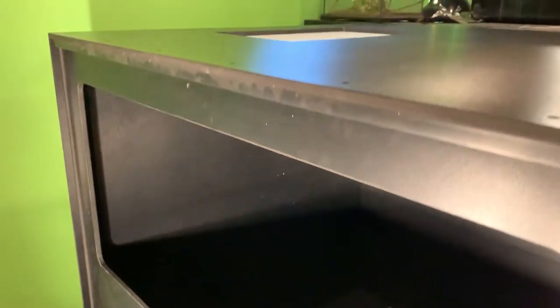And then what comes next is you have to seal it. So you have to climb in, take that silicone, and seal the entire inside rim. Now that it's all screwed together nice and tight, you seal that with silicone. What I did is I took the silicone and went up about 2.5 feet up each wall in the corners, so that the seal would go up all the way to where there was going to be substrate. And you need to let this cure for a week.